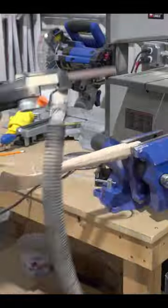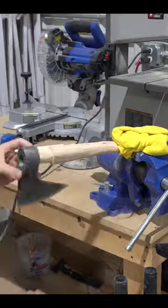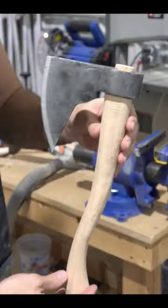I'm going to throw the handle in the vise and start sanding away at it with my detail file sander that's got an 80 grit strap of sandpaper on there. Once I've got the handle all smoothed out to my liking, we've got to trim out the eye so that it will actually fit in our 3D printed axe heads.